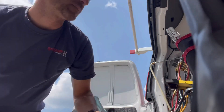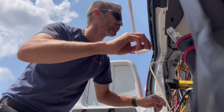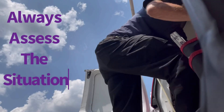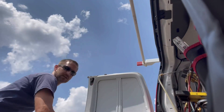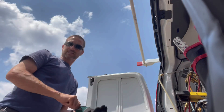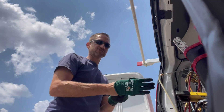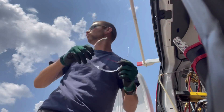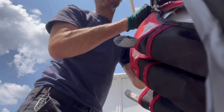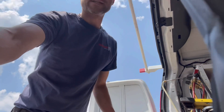I walked in and met up with my customer. It's 79 degrees on two of the thermostats and 72 or 74 degrees on another one. I just glanced up on the roof and saw one unit is running and another one is not running. So most likely the one that's not running is the one we need to look at. I've verified the thermostats are set for cooling, and now I'm going to go up and check power at the unit — make sure there's not a blown fuse or anything. Definitely warm out, I'm gonna grab my sun hat.